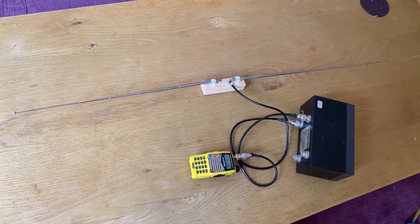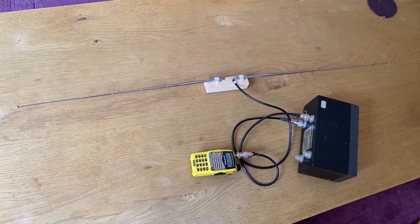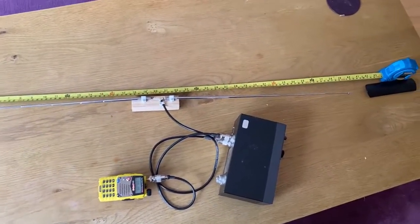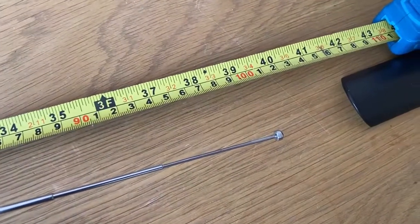We're testing on the frequency range between 144 and 146 MHz, which you should know is 2 meters. So a half wave of 2 meters should be 1 meter. And there you go — just about a meter. That hopefully explains the basic principles of SWR tuning.